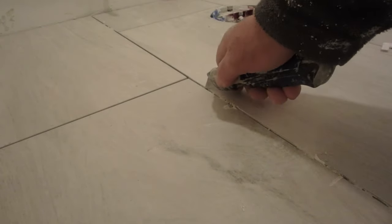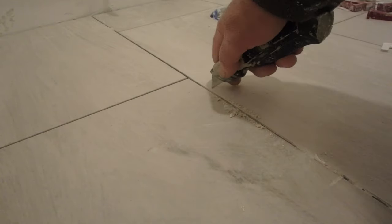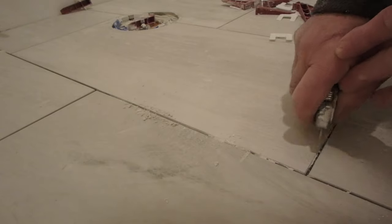Best to make sure all your grout lines are clear. Pretty much everywhere they're clean, but sometimes it's unavoidable and you get some bleed through. So when you clean that out, remember you have heat wire under the tile, so don't go too deep. Just clear it out just enough for the grout. Best to do it the next day when it's still relatively soft. You don't want to cut the wire